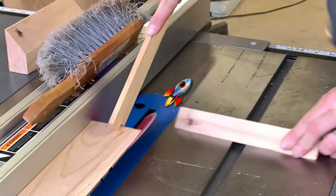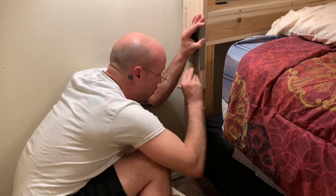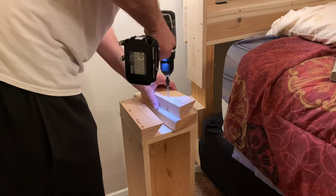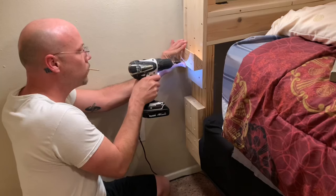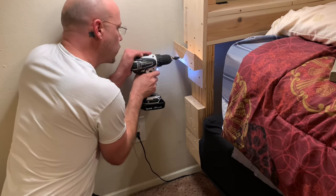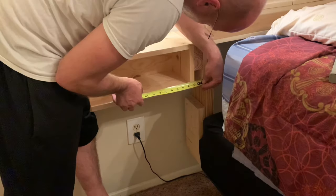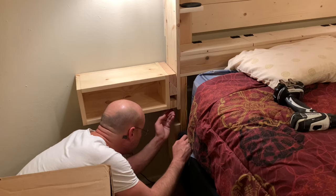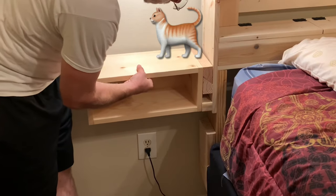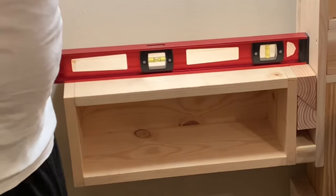We are barely going to make it through this project with all our parts and pieces still intact. I'll get back to the job site and start taking some more measurements. Hindsight is 20/20 — looking back I may have mounted the nightstands even with the height of the headboard storage area instead of the height of the mattress, but this is an easy adjustment that can be made later. I'll mark where I want to pre-drill the holes for the cleated bracket that will mount to the headboard and quickly mount that up, pre-drilling again through the cleat into the headboard to make sure it sits level. Once this is installed I need to attach a piece level with the bottom of the nightstand to keep it from twisting the bracket off — I just use the end of a 2x6, again pre-drilling the holes. I don't know the exact capacity of this setup but I'm sure a fully grown house cat could stand on it with no problem.